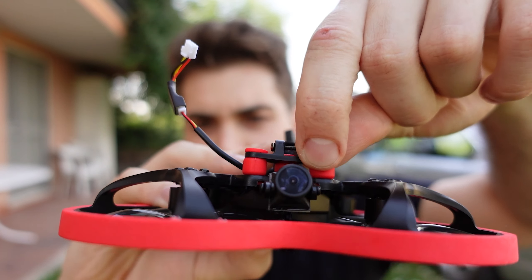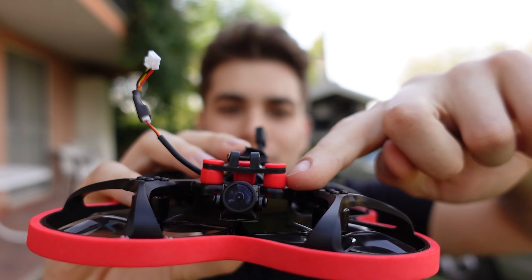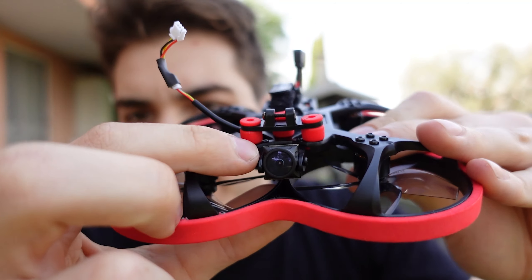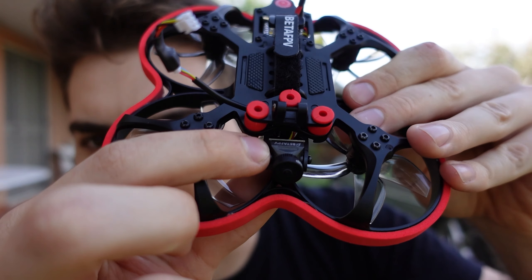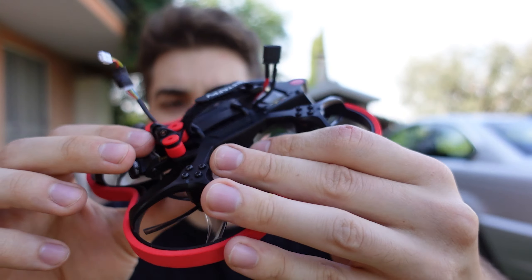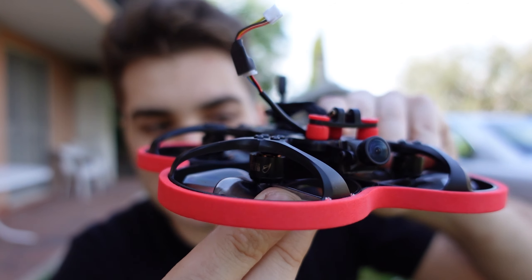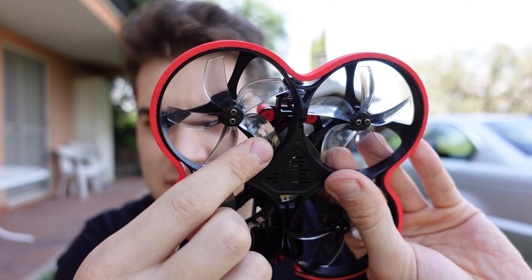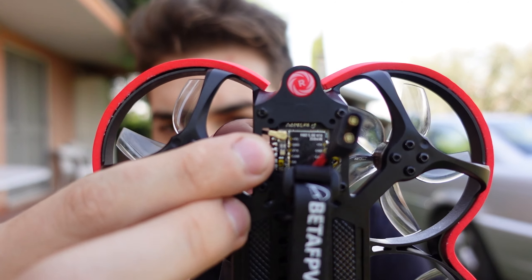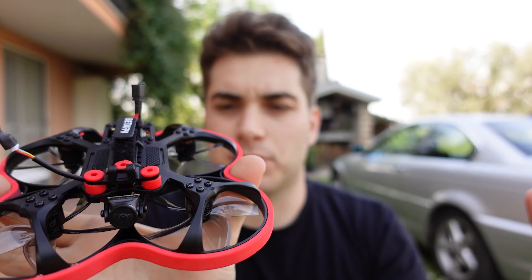For cinematic flight, those grommets save you a lot because the drone shakes and they remove jello from your camera. Red grommets — I like them. We have a BetaFPV-branded EOS 2 from Runcam, a 14x14 camera, and I always use these for analog. Then we have 1106 3800kV motors — and I'll tell you later why this is a big issue. There are 5-bladed Gemfan props, a 20-amp all-in-one single board flight controller, 250 milliwatt VTX, and the whole drone weighs 100 grams without battery or GoPro.